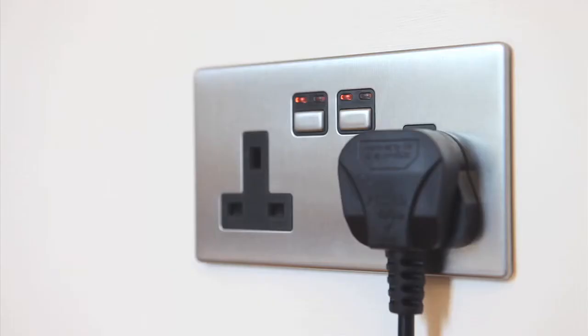If the LED slowly flashes amber, this means the LightwaveRF device memory is full and no further control devices may be linked with it, unless one of the existing controllers is first unlinked.